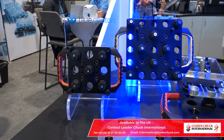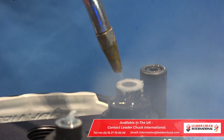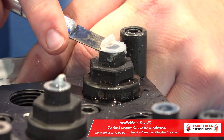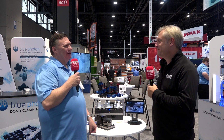Finally, cleaning it all off — because you've got that adhesive on there. Nice and simple to do: you just twist the gripper a quarter turn. If your part is really delicate or thin, you want to put it in some hot water, then peel the part from the fixture. We use a little steam just to get the adhesive hot and it peels right off — nice and simple. So there you have it from Dan at Blue Photon: complex parts made really easy.